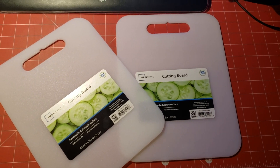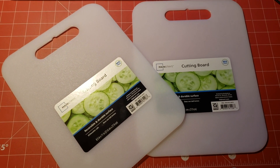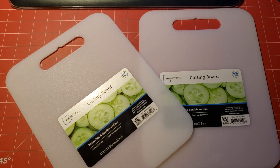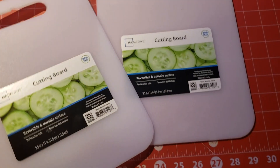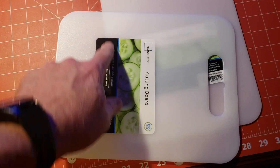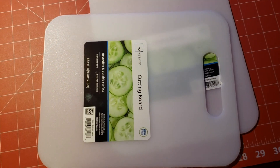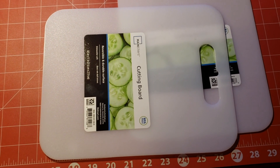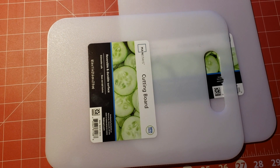One of the main things we need for a dipole is center insulators. You can go buy some, but I don't really want to spend 10 or 15 bucks for a center insulator, especially for an antenna I'm just going to use as a portable Parks on the Air kind of antenna. So instead, we went to Walmart — 88 cents. You can get a cutting board for 88 cents. We're going to cut out a little shape so I can wrap each leg of the antenna on each side, drill some holes to attach the legs, and use this piece as the center insulator.